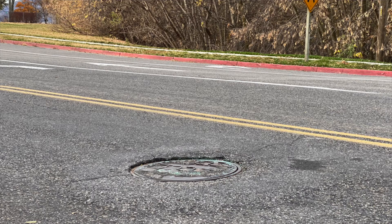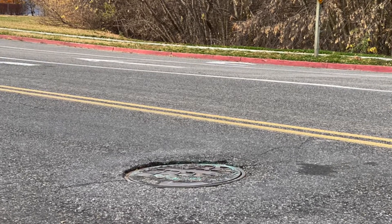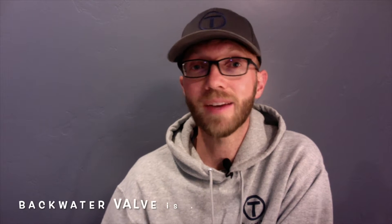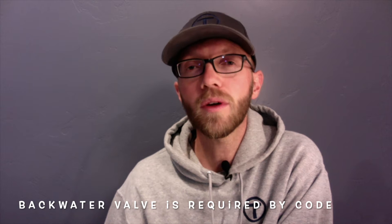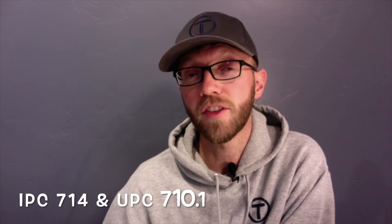Let's think for a minute. What happens when the sewer in the street gets blocked? Sewage would of course back up, and the overflow point is the manhole on the street above. But what happens to a house connected to that sewer if the basement — or even more of the house — is below that overflow point? Well naturally, that sewage is going to come right back into the house. Thankfully, some ingenious engineers have designed what is called a backwater valve. This will allow drainage from the house to pass through, but if there's a blockage outside at the sewer, it will stop any of that from coming back into the house.